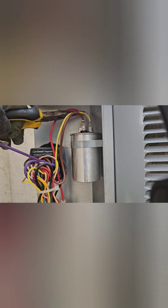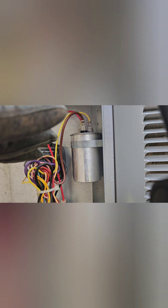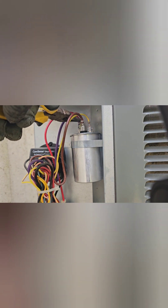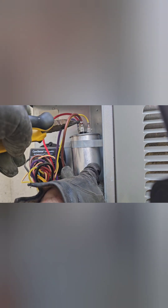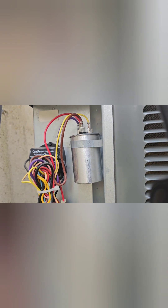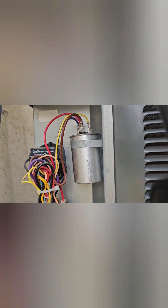So put them all on exactly how they used to be. Once I pushed in my fuse, just like before it cycled, but this time the fan actually spun around. I gave up — I didn't think I fixed it. I walked away, and the next time it cycled through with the thermostat inside it did start up and it worked. I've had AC for a few days now, so it was the thing that was broken.